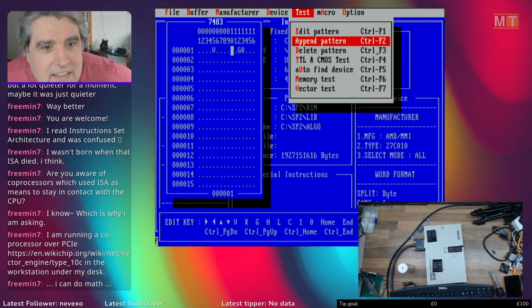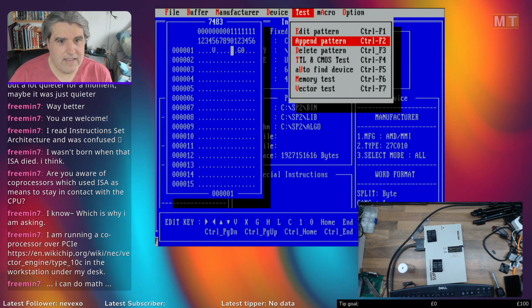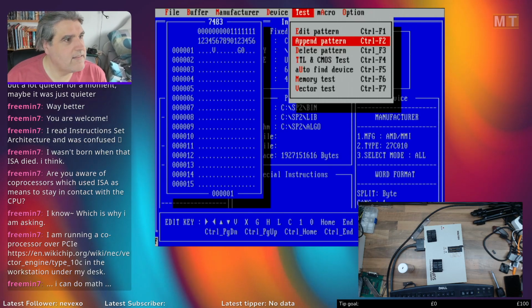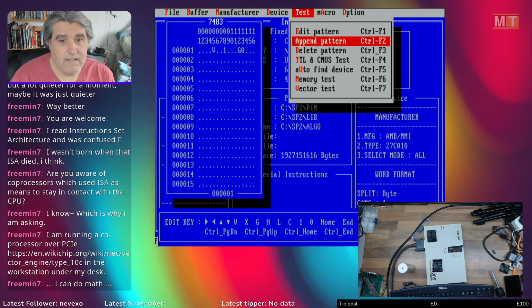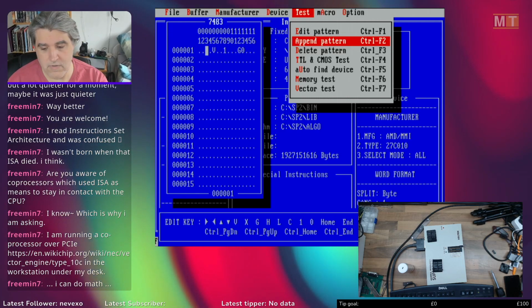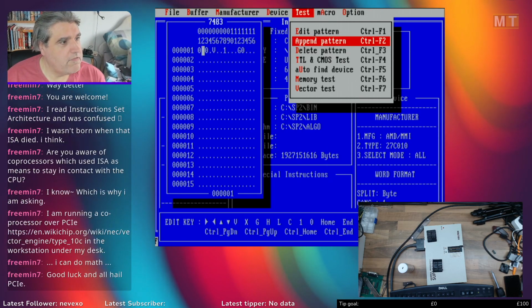Anyway, back to the 7483. I wanted to input the value 2 to operand A. So A2 is pin 8. A2, pin 8, I want to set that to a 1. A3 is pin 3. Set that to a 0, and A4 to a 0. We'll see if this chip can do math. So we wanted to add 2 and 5.